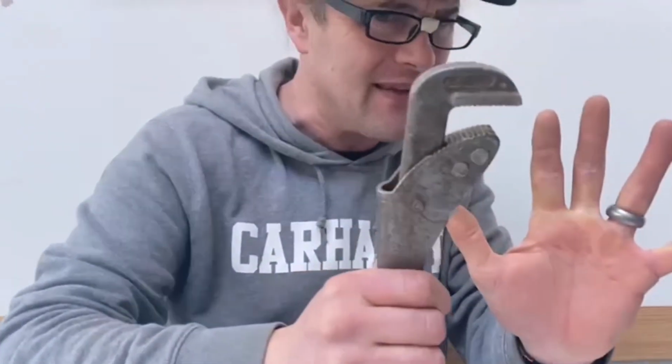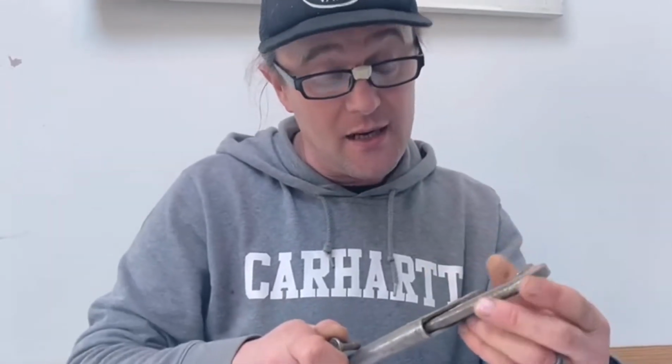Some people don't like these. They've been around for a long time, obviously 100 years, but that is part of plumbing history and I love them. I always have footprints in my toolbox. If you're taking out an immersion heater, which is a really big nut, look at that! I've drilled the body. I put it on a press drill and drilled extra holes in there. An old gadgie told me that when I was starting out. He said get these drilled out.